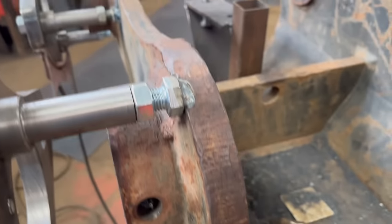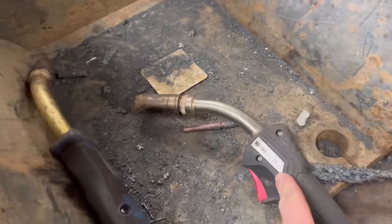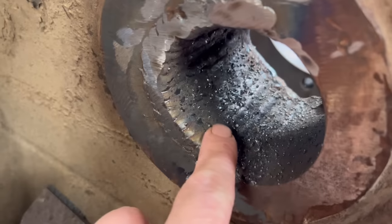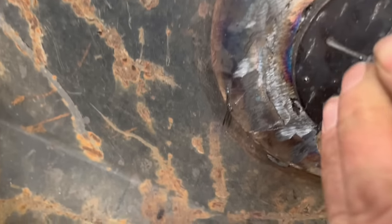it's filled up anyway. But then when you look at this side, when I did the other side, I changed onto the smaller welder, which that one's on 1mm wire and that one's on 1.2mm wire. So there's not as much splatter on this one. I was using my little template that I cut out as a guide to see whether I'd got enough weld in there or not.